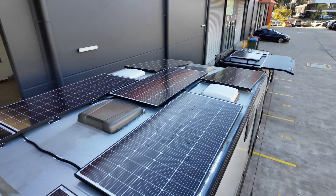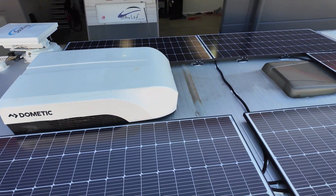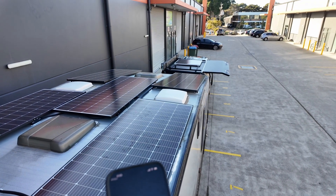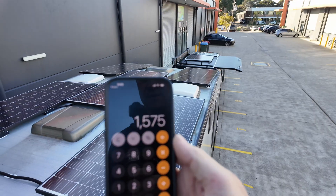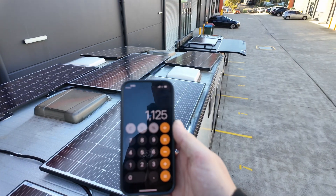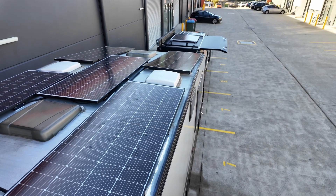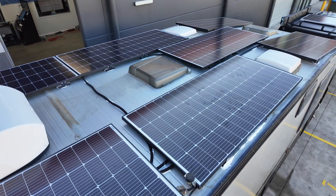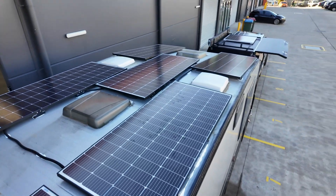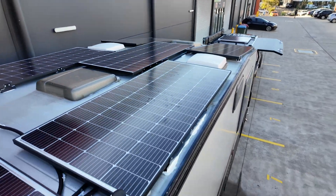Very good setup this. It also made our life easy because we completely took up what was already on the roof and started from scratch. So total: 225 times seven gives them 1575 watts total, with the five center panels going through the 70 amp charger giving about 1.1 kilowatts of solar. They can expect to see 70 amps of charge through the 70 amp charger, and then probably just over 20 amps through the charger looking after the front two. So they can be driving down the road getting anywhere from 70 to 90 amps of solar through the solar system.